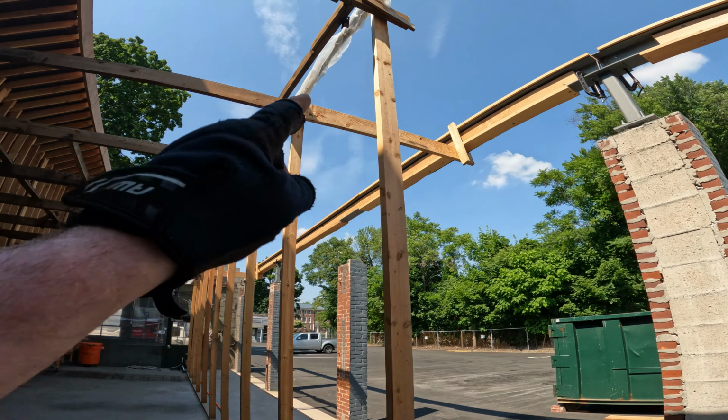And what that does, the reason we need to get this in as we put rafters up is because that holds them together on the bottom, so you don't have an outward force pushing the top of that post. And until this rafter tie is in, this board has a lot of torque to it, and so it wants to kick out the post that way. Kind of ties into the whole discussion I've had about ridge beams versus ridge boards and rafter ties and all that.